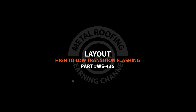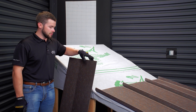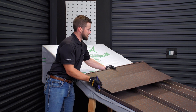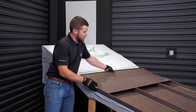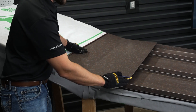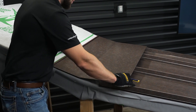First step — we're going to be installing all of our panels down below. We already have that process started and finished up. So now we're going to be taking our Pitch Break High to Low trim and setting it on top of the high of the panels. The main thing to watch for is making sure it flushes out and stays on the same plane as your lower pitch down here, so you don't get any water pooling on the actual pitch break itself.